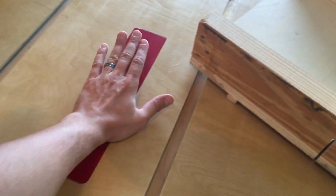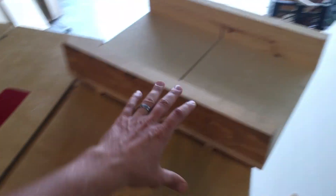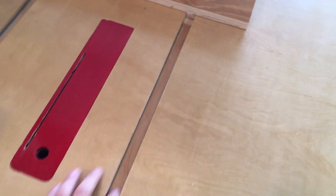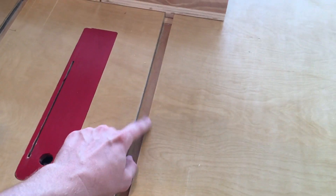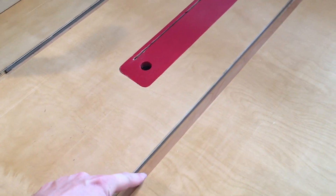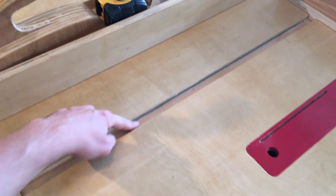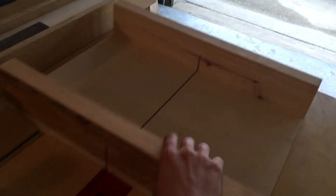Once I had all that, I raised the blade through here. I hadn't even put the zero clearance insert in yet — I'll get to that in just a second. But I wanted to have a sled for some cross cuts, so I needed to cut out the runners. I basically figured out where the tracks were, drilled in, and used a router bit with a follower to get these channels, then used my fence to continue that cut all the way to the end. That's how I got my tracks in there, then I built a sled and was able to do some cross-cutting.